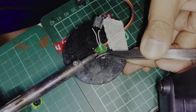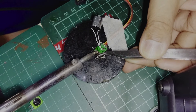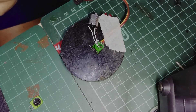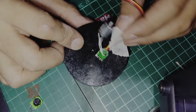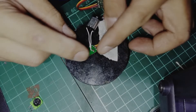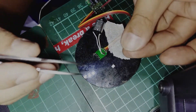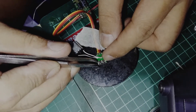I'm cleaning up the solder so the SMD resistors will lay flat nicely on the servo board. My DIY desoldering braid is working now. As you can see, where the potentiometer was soldered it's now very clean. The resistors I'm using are 2.2 kilo-ohm SMD resistors — marked '222'. I need to line them up so both resistors touch together at the middle terminal of the servo board.